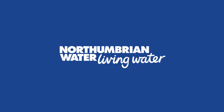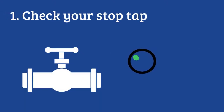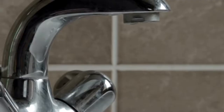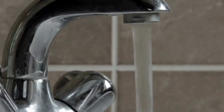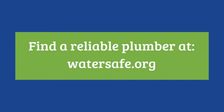If you've just arrived in your new home, here are some easy steps to manage your water supply as simply as possible. First up, check your internal stop tap works. If you've ever had a leak, this is where you turn off the water supply. Most stop taps are under the kitchen sink or in the bathroom. Check it works by turning your cold water tap on and then turning the stop tap off — your cold water should stop running. If it doesn't, you'll want a reliable plumber to fix it.